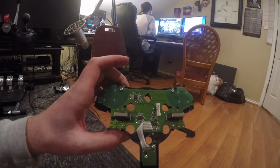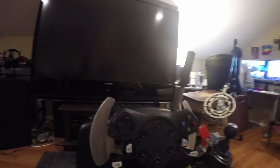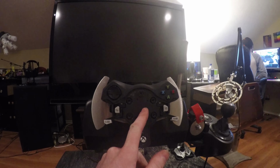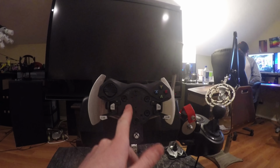Sweet. So I got the circuit board installed, put back as many screws as I could. I have 1 left over. The other one just felt stripped, or it felt like it was gonna strip, so I'd rather have no screw than a stripped hole. So now I'm gonna figure out what to do next. So I connected the little 6-pin connector in the rear to it. Holy smokes, almost fell over, crouching. But I reconnected the little 6-pin connector and then pushed it back in.